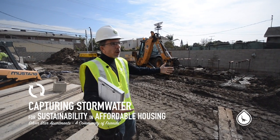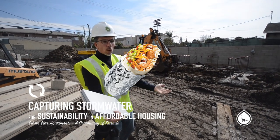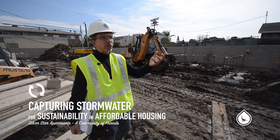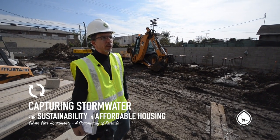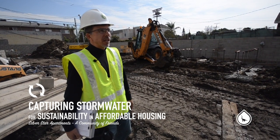It's probably 40 feet by 40 feet by about 10 feet deep, and it will be one big burrito fabric bag full of gravel that will grab the water and allow it to slowly percolate into the ground. What that does is it recharges the water table and puts less stress on the stormwater infrastructure for the city of Los Angeles.